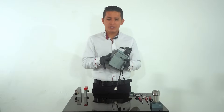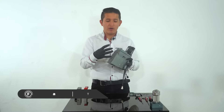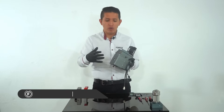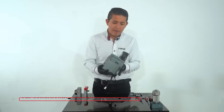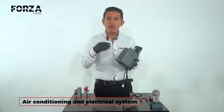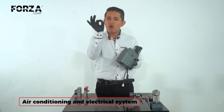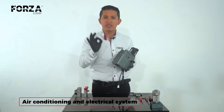Let's move on to the heart of the head — the part where the focusing lens is located. The collimator lenses condition the laser light so it has the right shape for cutting. We also have a servo motor which moves the focusing lens to perform piercings or different stages, setting that fine part of the laser exactly in the position we want.